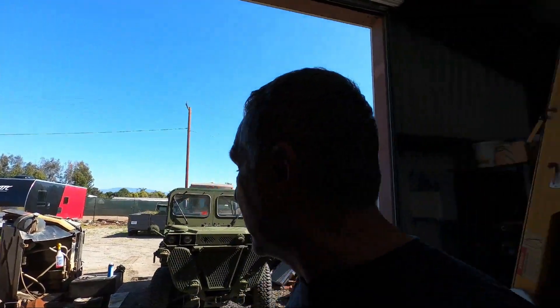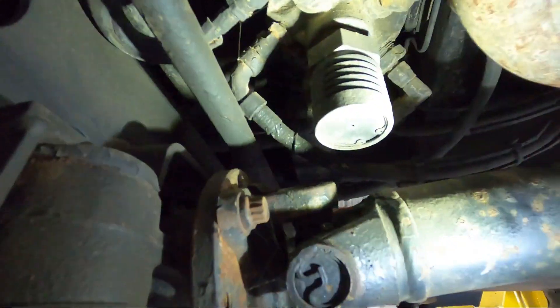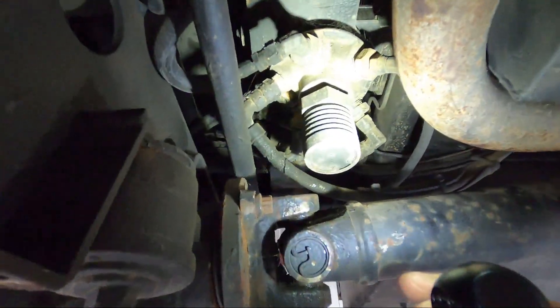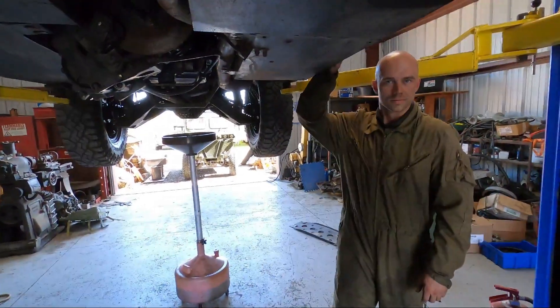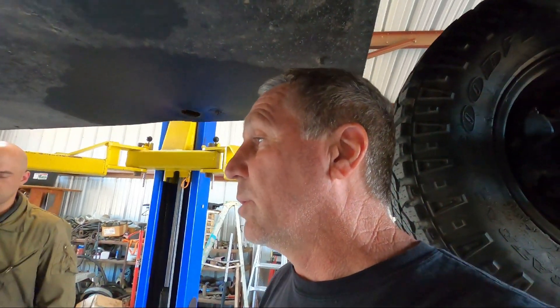It's heading off to Tennessee as soon as I'm done. The central tire inflation system started screwing up — it was puking air at the exhaust muffler. We threw it up on the lift. This is a different one here, ITV 111, just to show you where the valve is located. You drop the main pan and right down here is the valve, located right above the yoke for the rear drive shaft. Kind of a pain to get out. I did pre-take it apart to see what's inside so there aren't weird surprises when I film. I'll pull it apart again, show you what we find inside, put it back together lubricating the seals, put it back in the Growler, and see if it works. So if you see this video, it worked.